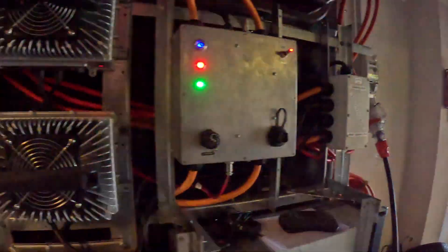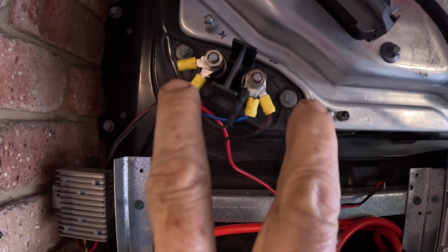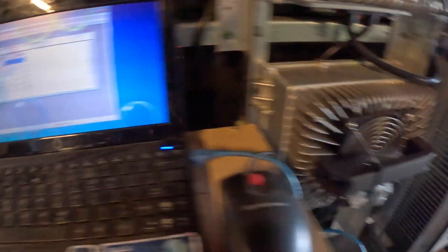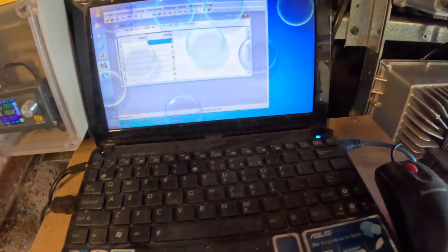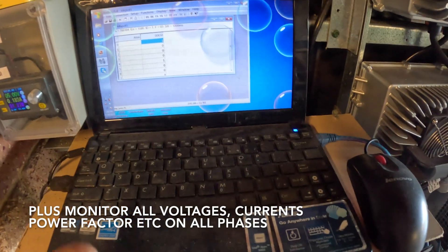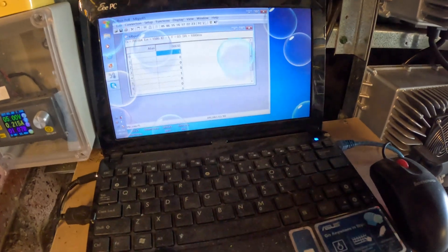The Model 3 battery — this big black thing — is the whole black unit that sits underneath the Model 3 car, which is over there. It generates 12 volts and is capable of 140 amps. I feed a buck converter to get 24 volts to run the laptop, and that laptop lets me talk to the inverter to tune what I want — on/off, power settings, whether I want it on-grid or off-grid. I don't actually need the laptop; once it's working I can disconnect it and it just keeps running.